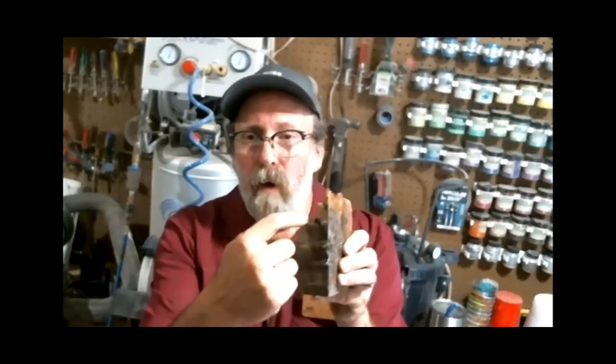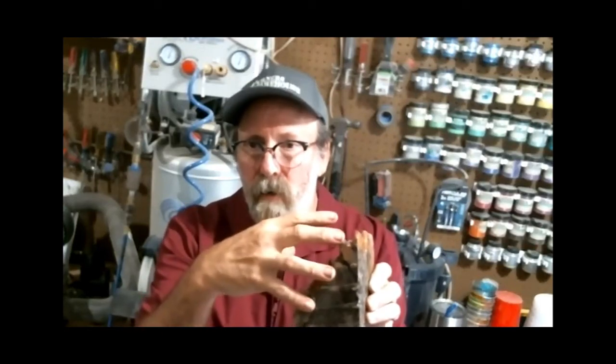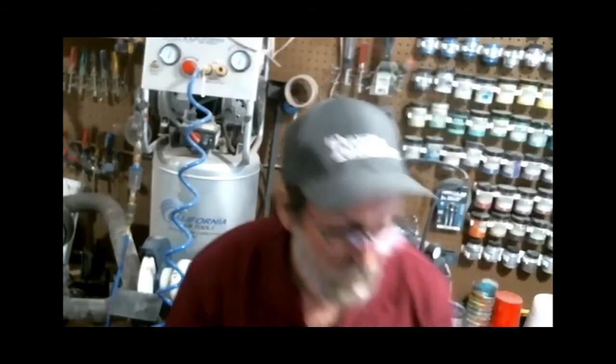Now, once I trim it, if I see bubbles along this burl line, that's moisture from inside the burl. If you see foaming, that's a lot of moisture from inside the burl. Or it could be moisture from your air compressor. So I use a moisture trap. You've got to keep all the moisture out. This stuff is just extremely sensitive to it. So that's the biggest. We have another question about what about infusing wood with cactus juice?